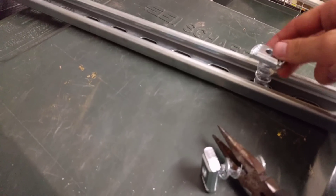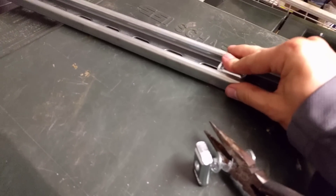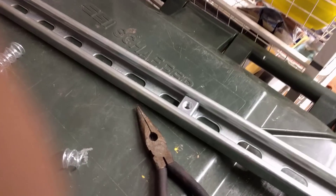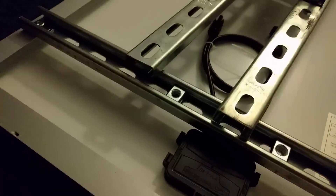To help mount everything together you can use spring bolts, which just pop inside the unistrut. My unistrut was a little thin so I cut down my spring bolts so they would fit inside. Once the spring bolts lock in, we can bolt everything for added stability. I used the spring bolts to attach the unistrut to the solar panel, the unistrut to the satellite mount, and then the spring bolts again to attach all the unistrut pieces to each other.